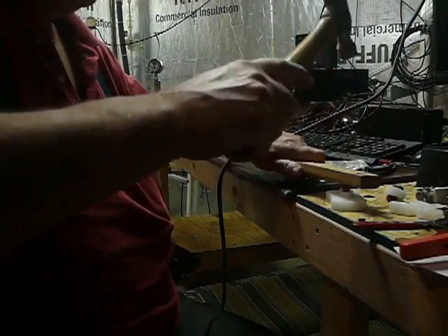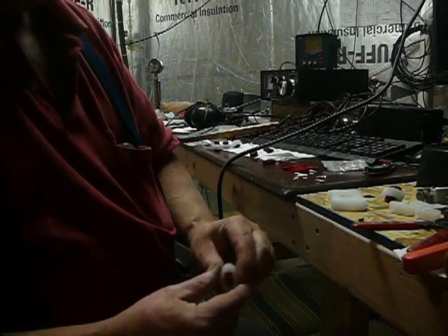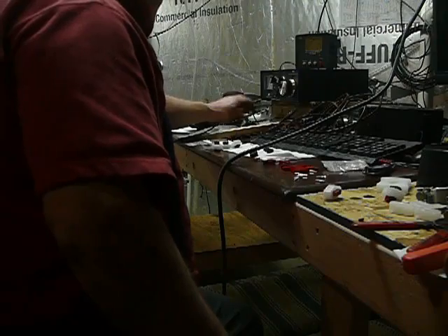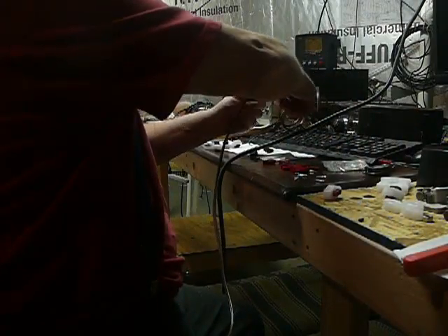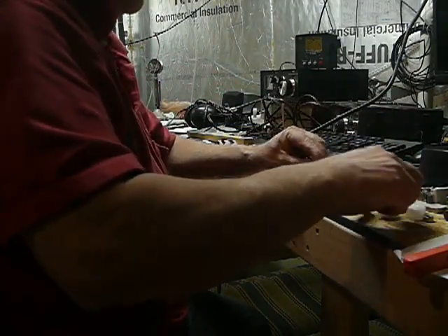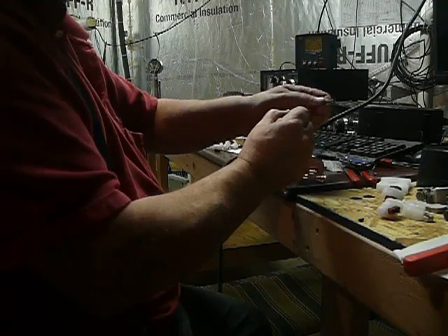So a few presses or so, and then you just clean off some of the plastic that comes out, and now you've got a neat little gizmo. You can hook the wires on — I'll show you how the wires go on. I'm using zip cord, but use any wire you want. This is 18 gauge. The power poles come in 15 amp, 30 amp, or 45 amp versions.